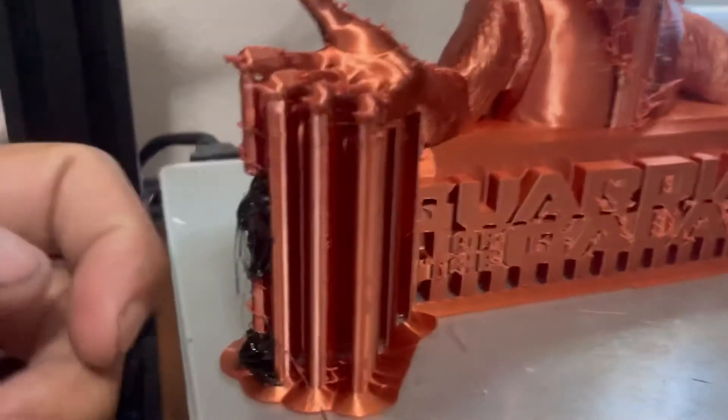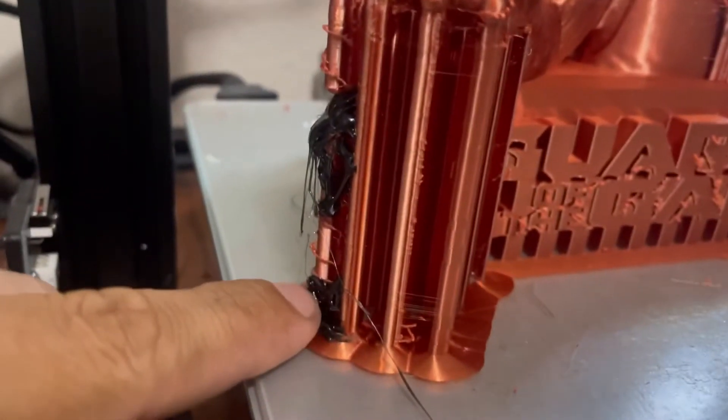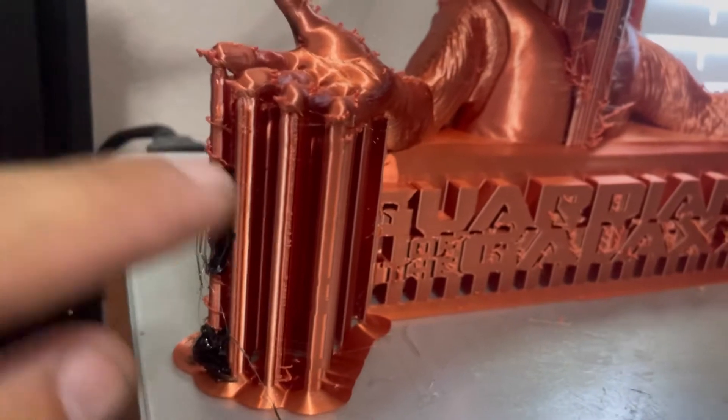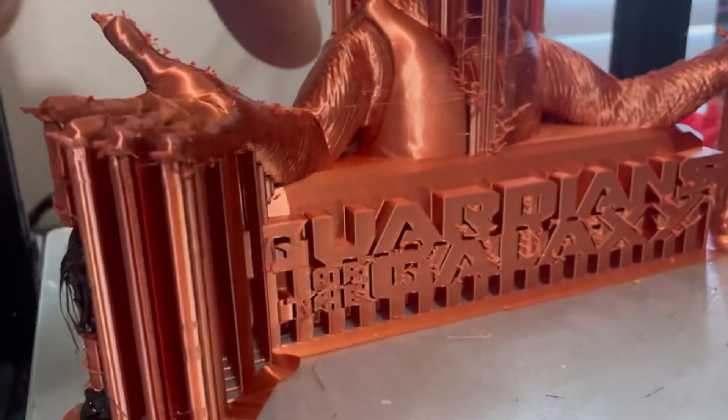You can hear it slowing down, and that's exactly what you want. You do need to work kind of quick. I turned it down to 70% and then just took some hot glue — first I put some on the bottom structure to get it back to being firm. Then I just started feathering in some hot glue. You don't want to put it up too high because if you do the nozzle could hit it and put you back in the same situation. Take your finger and push it down to smooth it out. It's a patience game — monitor the print to make sure when the nozzle comes over it's printing and grabbing on.